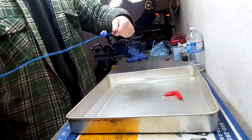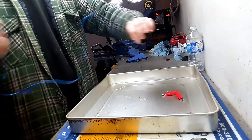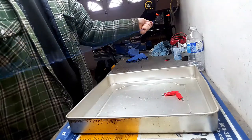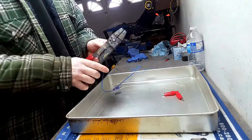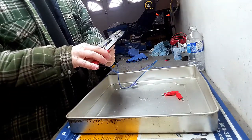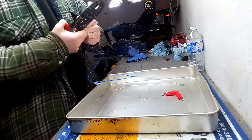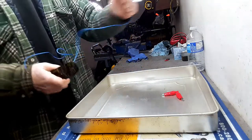First things first, just make a length of wire. This is I think a 16 gauge wire, just a piece of scrap wire I had — whatever length you want. You're going to strip off both ends using your wire strippers, about a half inch on each side.